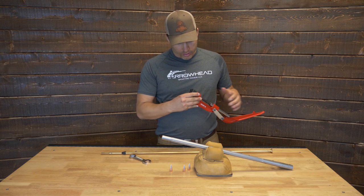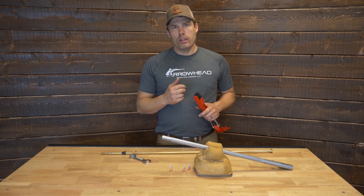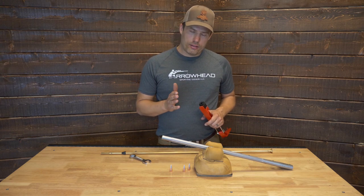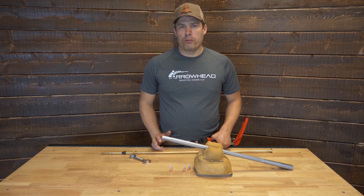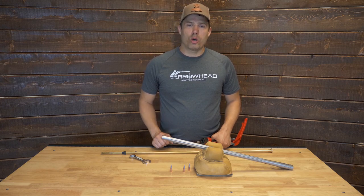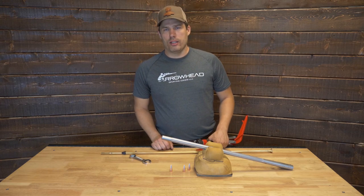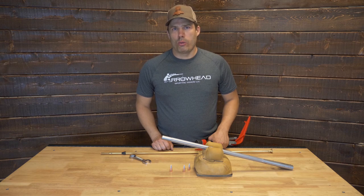The die comes with 40 hash marks and it's set at zero. The zero setting is .452 caliber. As far as what die setting — I always get that question, what size bullet. Every barrel's different. The Encore barrels with the preferred blanks are typically running a 13 to a 17, somewhere in that neighborhood. The Brooks and Bartlein barrels are running anywhere from an 8 to a 12.